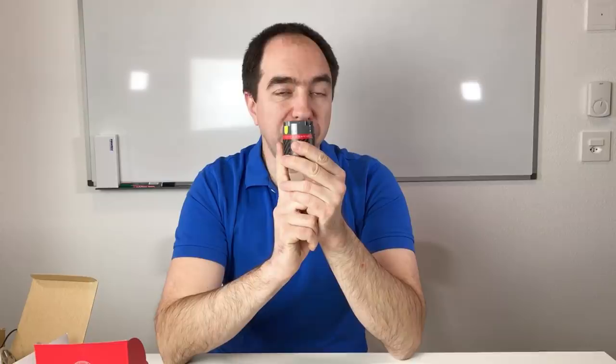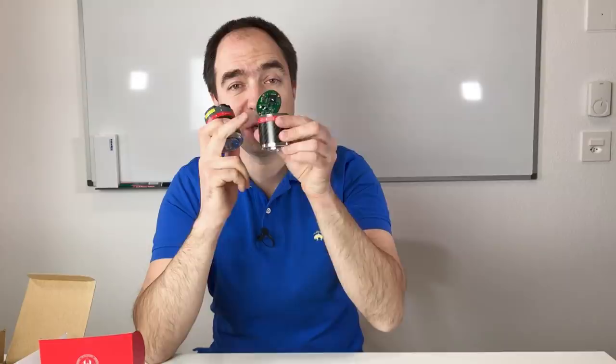is that I have two actuators like this one, and one of these two actuators does not work properly anymore. Meaning that it does rotate, it kind of does work, but it always loses its home position. So one time I switch it on, it has one home position, another time I switch it on, it has another home position, and it looks strange. So I suppose that battery in one of these actuators, actually in this one, which I already started to disassemble, is dead. Probably we just need to replace this battery and everything is gonna be okay.